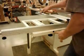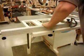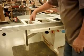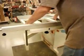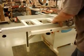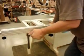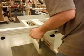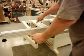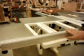Now you're 90. They have one here and one here, so you have an option of front and back, which is nice. And I like it here. The other thing is, they've given you 3 holes to set that swing arm in. I want to get as much travel out of this as I can, but that swing arm can only go so far. So they've given you 3 options, 1, 2, 3, to come into. Well, that gave me another 8 inches to come back.